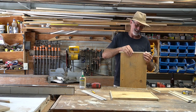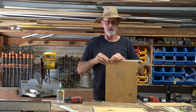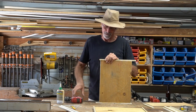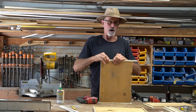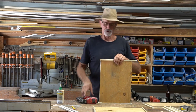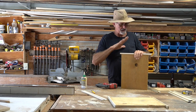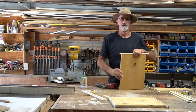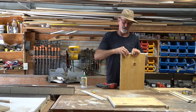I'm putting glue on both surfaces, just like I was taught long ago in high school wood shop — I don't even know if they have high school wood shop anymore. The top side is toward me, so I'm getting it as even as I can. Now this is a situation where you can listen to me because I do know what I'm doing when I'm working with wood. It might not always look like it, but I actually do know what I'm doing here — unlike so many other things. Always my disclaimer: if I'm not here in the shop, find a YouTuber who really knows what they're doing. Another reason for putting the ends on first is when this front piece goes on, it'll cover up that end grain. Not a big deal, but it will make it look like you know what you're doing.